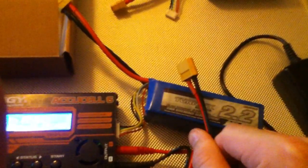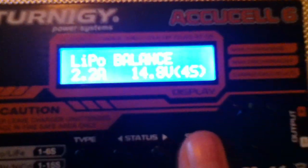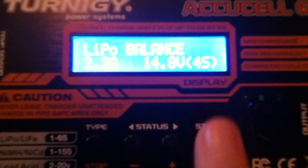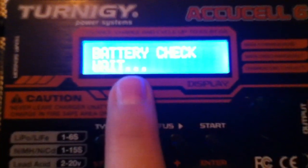Now I've got the power cable ready and the LiPo connected to the balance port. I'll connect the two main cables together — I'll put the camera down for a close look at the LCD screen. All connected and circuits complete. Back at the charger, hold Start for two seconds again for the self-diagnostic. If everything is connected correctly it should pass and confirm we're ready to begin the balance charge. It passes — all cables are connected correctly with no damage.